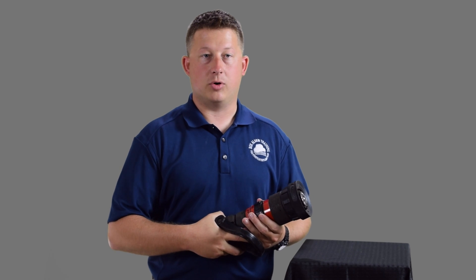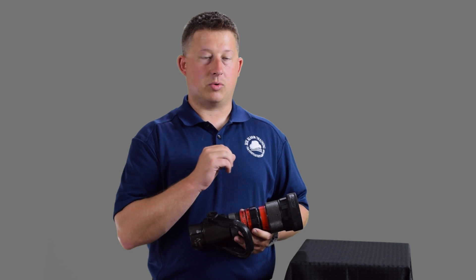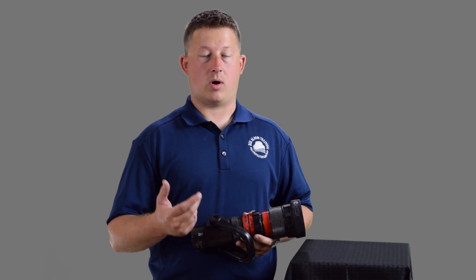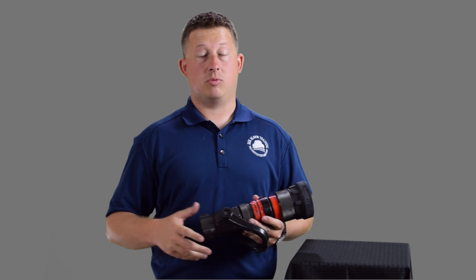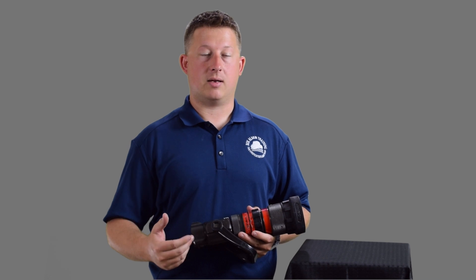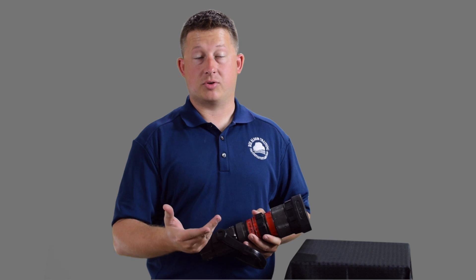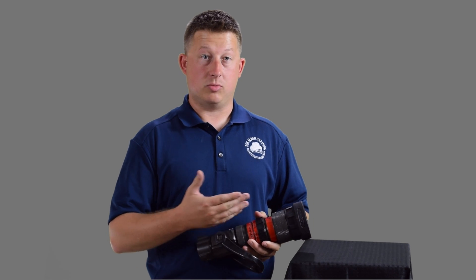On the other hand, it gives you a variety of flows to work with. This nozzle even goes all the way down to 30 gallons per minute — great for grass or wildland type fires where you can extinguish a large amount of fire with very little water and move quickly without wasting a ton of water. One downside is you could accidentally bump your gallonage adjustment to a lower setting when you're in a structure fire, and that is a situation where you don't want a lower adjustment — you actually want the water that you expect.